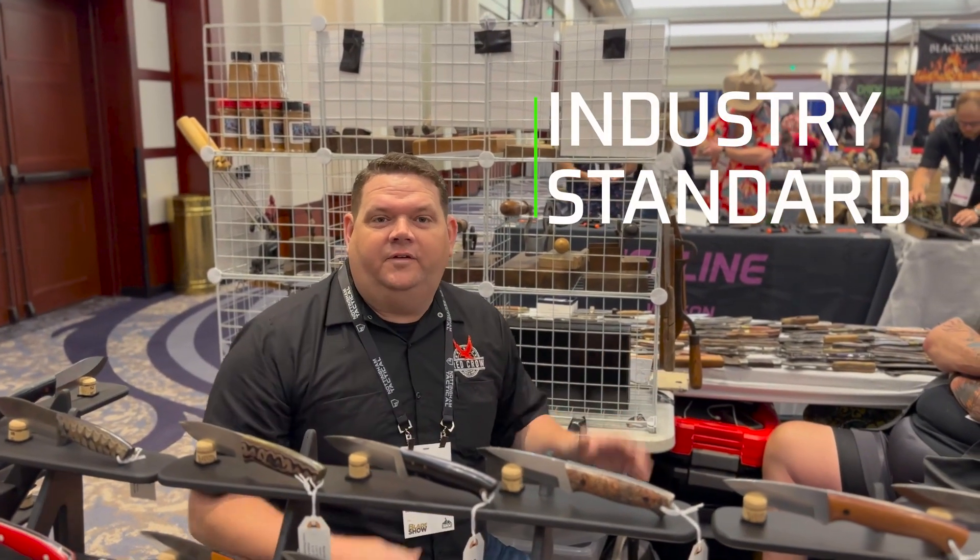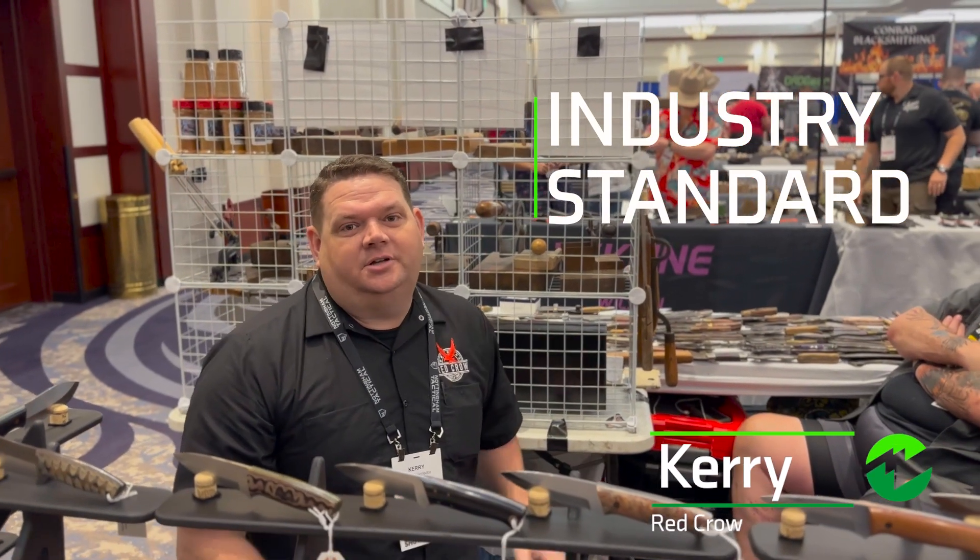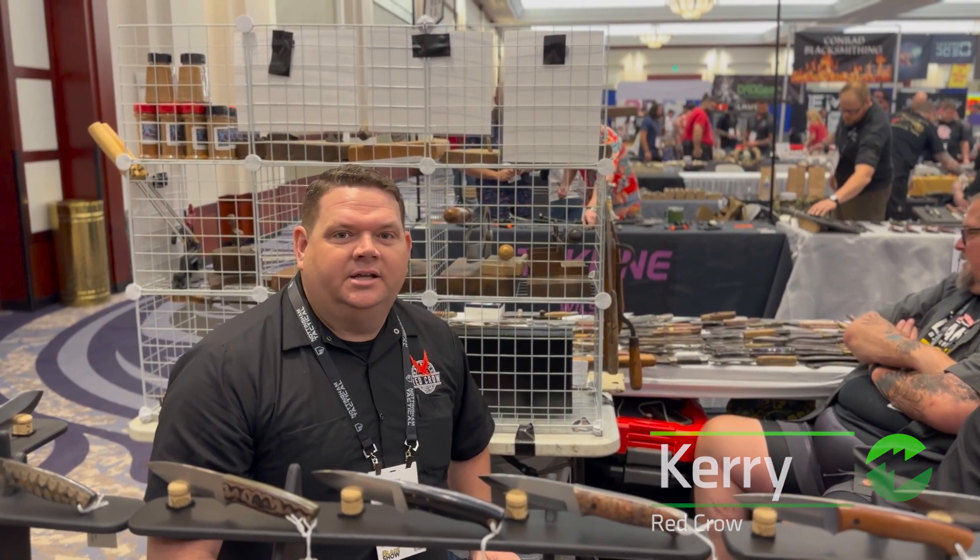A piece of kit like that's not something you really want to cheap out on. We love them. It's pretty much the industry standard for a good VFD for any of the knife grinders. We've got four of them. We've been using them for about five years on a daily basis. We've never had a single issue out of any of them. I wouldn't be able to do what I do without it. So roughing out blades, I can go from 100% on the speed all the way down to 20% for the finish work.